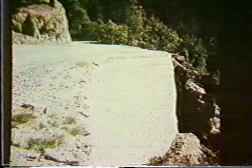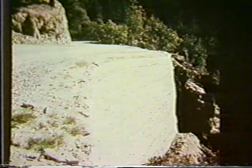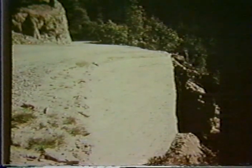And here's another application and another one, fairly high, up to about 16 to 18 feet as the maximum height for this system. Again, it's called stack sack and is described in the U.S. Forest Service Design Manual. As mentioned earlier, one can use grids, geogrids, or metallic grids. As I mentioned in the first presentation, the commercial systems use metallic grids. Well, here's an application where Caltrans are using the metal geogrids.